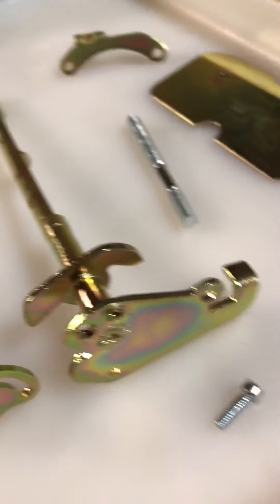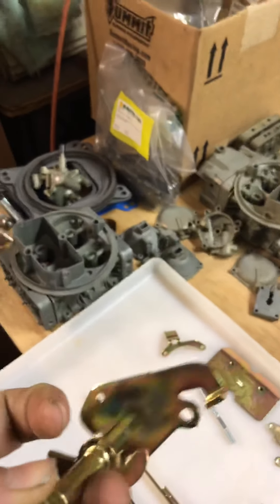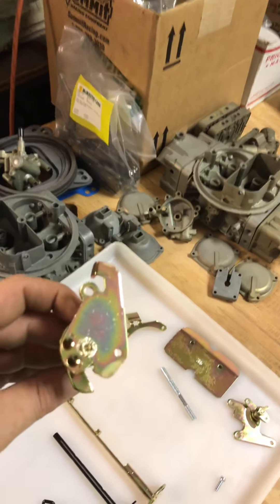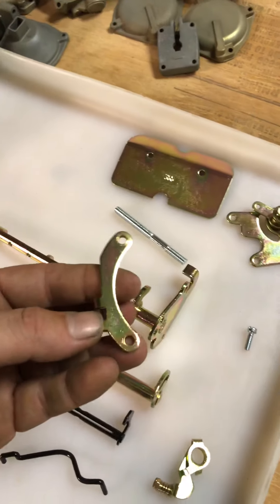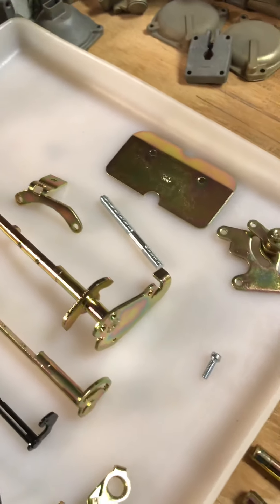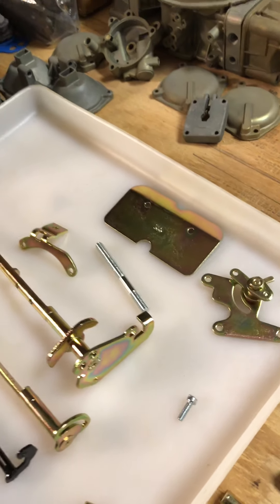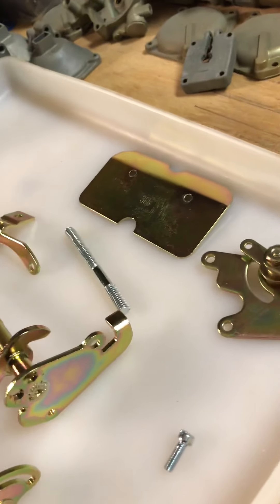the better the coating will be. I find that as much amperage as you can run without burning the plate provides the nicest, thickest, smoothest coating. Making sure you filter your solution really well is key — if you don't, if there are impurities in the solution, you get some roughness. This came out smooth like it had been sanded.